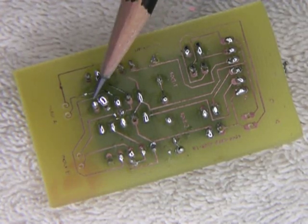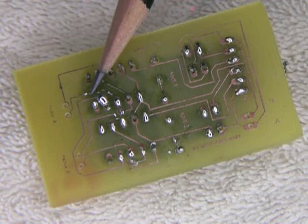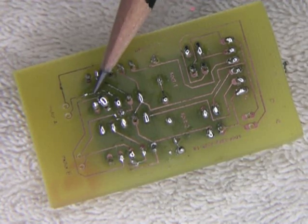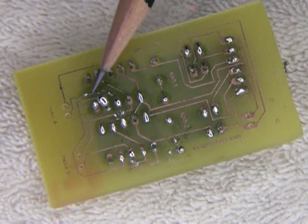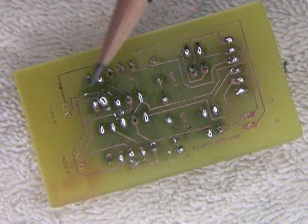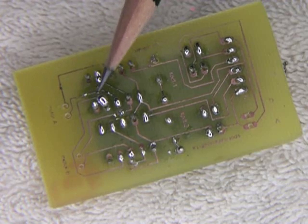There was another piece of trace here that I attempted to remedy by drawing some solder across the gap, and that seemed to work. I could test it with continuity and it seems to be fine. But we're going to try something different for this area.